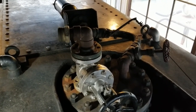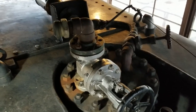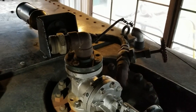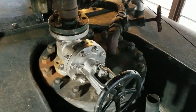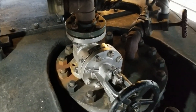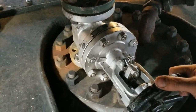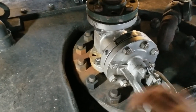This valve was put in specifically for the whistle blow — it's a two-inch gate valve — and we had the connection to the steam hose going over to the manifolds. But in order to drain the water out, we need to have a vent. So we'll open this up and give ourselves a vent, and then drain the water out of the blowdown.